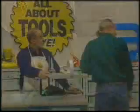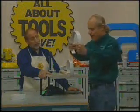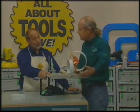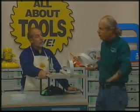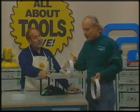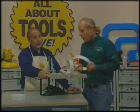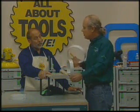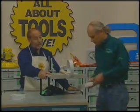Well, on a wider top, if you have let's say a 30-some inch top, you can go to the 8-inch clamp, and you've got the same. Even if you've got 7 inches here, you've got the same clamping pressure with the larger clamp. And if you need to, you can even go to the 12-inch clamp. These rails come for vanity size on the Cove and kitchen size. So there's one, the kitchen size is a little bit longer. They will increase your productivity because you don't have to mess around with all the turning clamps and stuff like that.